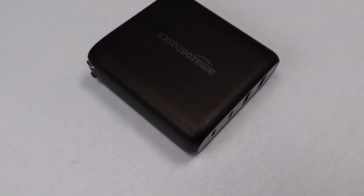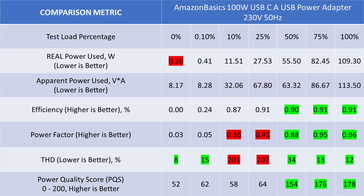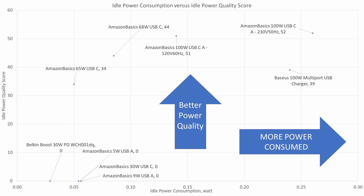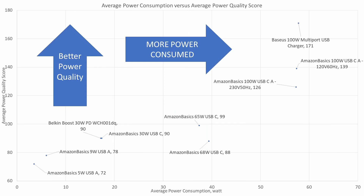Let's take a look at this device's performance when changing it over to 230 volts 50 hertz input power. It does a lot worse — the power factor circuit struggles to turn on and does not do as good a job at the higher voltage, and the idle power consumption is also higher. The net result is a 13-point lower PQS. When comparing each adapter to its category leader, the 65-watt is the leader, and actually the 30-watt is too. The 100-watt and the 68-watt are average. On the idle graph these adapters are okay, and the smaller adapters sip tiny amounts of power, which is a nice plus. The 100-watt suffers from the high on-point of the PFC, and the 65-watt still shines as the category winner.